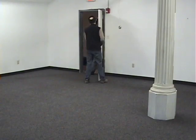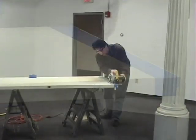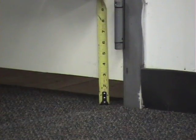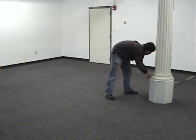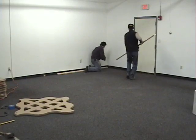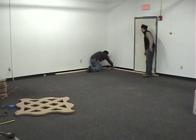We're going to start by cutting the bottom of the door so it opens over the 2-inch height of the Rosco SubFloor. Take time to measure your space. We're going to start with our panels right up against one side and use customizing panels only on the other.